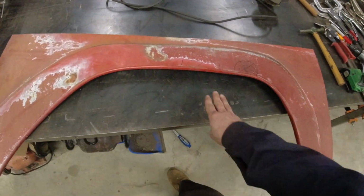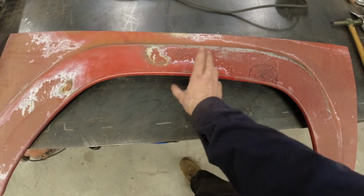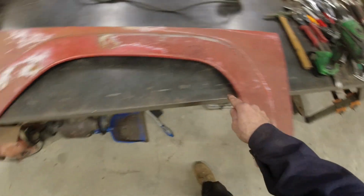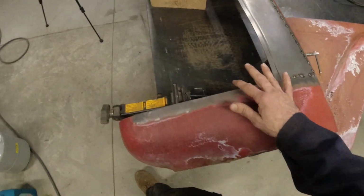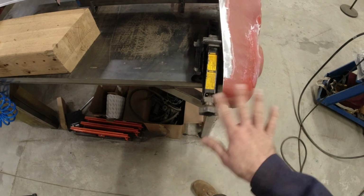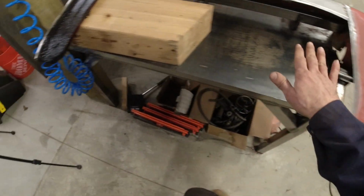Basically, I'm going to take 3 inches out of the center right here, squeeze that together. Once that's all welded up, we'll take this corner right here. We'll put it back where it goes in this corner, only 4 inches lower. It will extend farther down, of course. That's not an issue. We'll deal with that later. And then we will have about 5 inches of overhang right here.